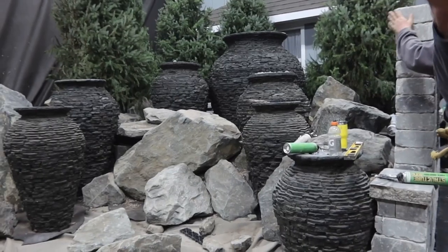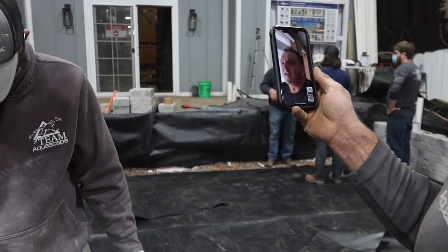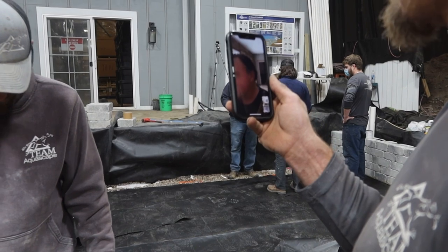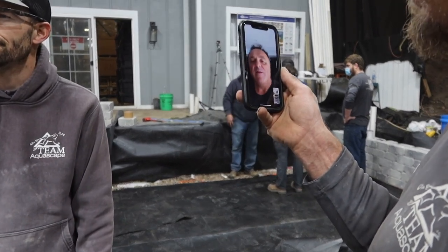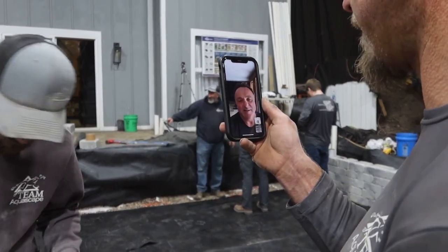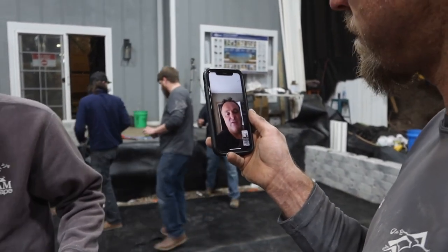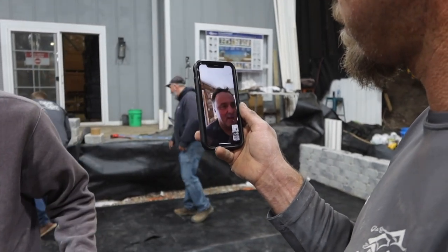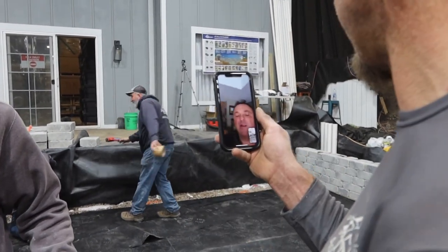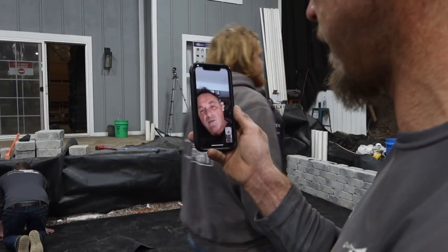Now, that intake area, we have to be careful you don't overfill this, because if you overfill it, it's not going to do anything, right? Right. The water level has to be perfect so that it's sucking out and creating that skimming. That's what I've got to figure out, the thickness of that water coming in over all those sides versus our flow rate of our pumps. But I'll figure that out, because that'll determine how high we build that intake. We don't want it too close and then we're driving water level up because we're pulling so much water in either. Yeah, I was thinking 2 feet up on it, like it should be 18 inches, right? That's what I had in my mind. I think you're right there, because we're at 2 feet of depth. The height of my posts is 25 inches, because we want the bottom of that bridge at an inch above water level.